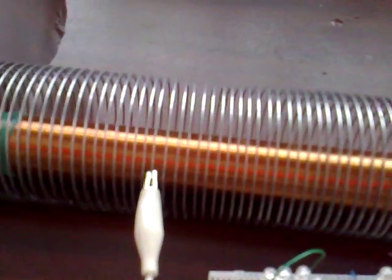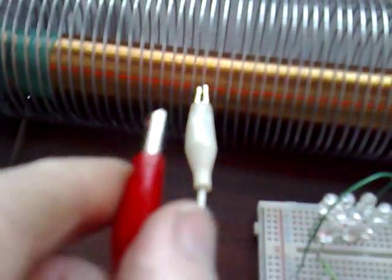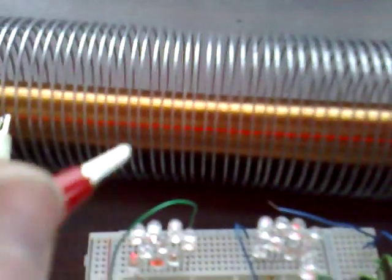Anyway, that's lighting up the fluorescent and it's on 20 milliamps. Now I'll start moving these leads towards the right. If you move towards the left it decreases the current and towards the right it increases the current. I have one lead fixed at that end and that stays there permanently. I leapfrog these two leads from coil to coil and that does the adjustment — and you can see the fluorescent increase in brightness.